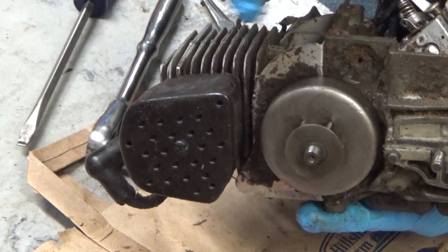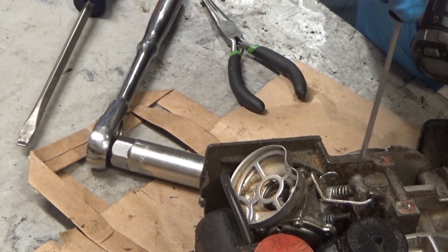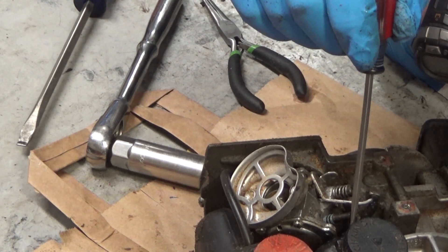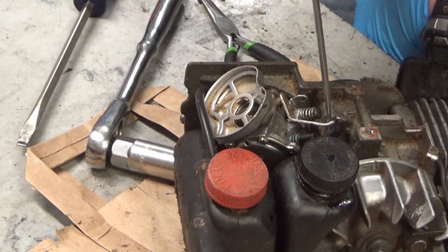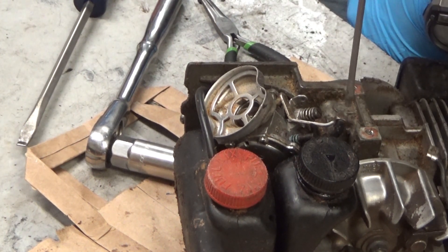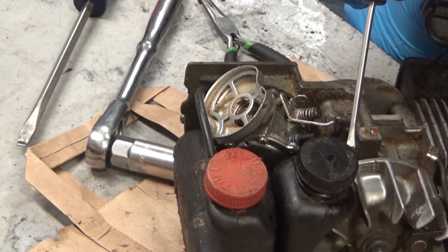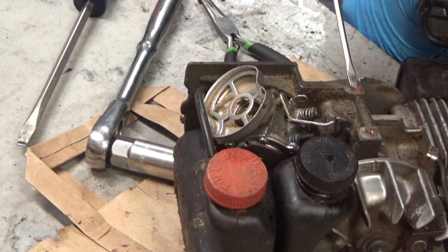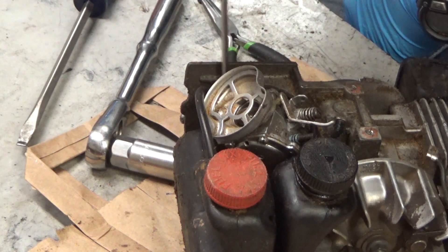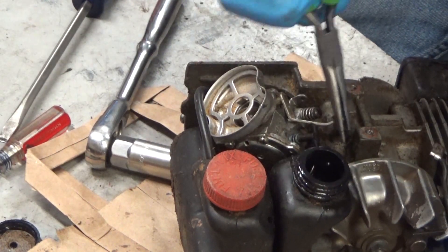If you had the diaphragm setup, all that hardware would be there along with a hose port right here where the pressure line would connect. Your oil discharge line — the one with the filter on it — would come over to this location, with another one below going down to the bar pad. Since this is crankcase pressure, this port goes down to the cylinder and on the downstroke creates a pulse. The duckbill valve allows the pulse in, closes off, pressurizes the tank, and oil comes out the lower hose to the bar pad. The hose is still here but there's nothing visible in the tank. It's broken off — pretty common.